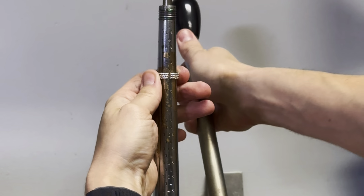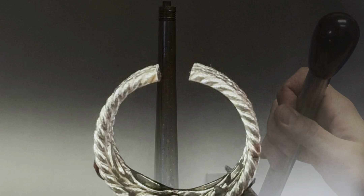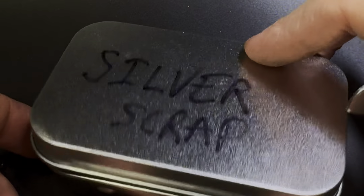She has a 3-row David Yurman confetti ring with hematite, onyx, and diamonds. After I cut it and stretch it open to the new size, I measure the gap and find a new piece of silver which I'll use to fill it in.